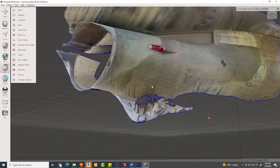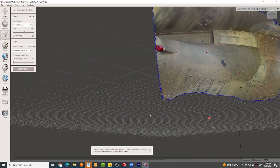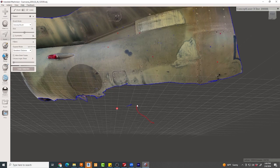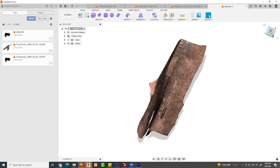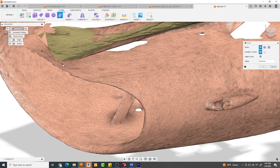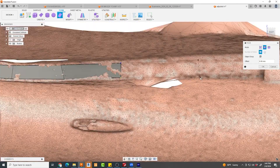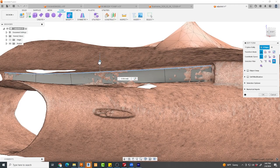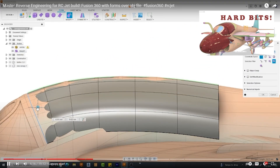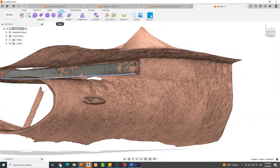This is what you see here. All I'm doing is selecting geometry that I want to delete. This is probably an environmental problem more than a limitation of the software, but I'm only able to get sections of the aircraft accurately. So I'm often deleting pieces where I couldn't get the right angle for the scan. From there I export the model and import it into Fusion 360. Just like in my previous videos, I can literally model over the top of an OBJ file. The mesh density is insanely tight — far more than you'd ever want — but using Fusion 360 tools I can get the geometry I need.